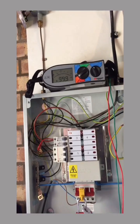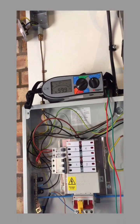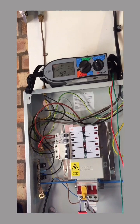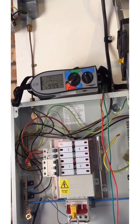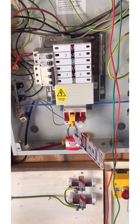At the back of our minds all the time is health and safety. Before we even get to this point, there might have been a number of procedures we've gone through, including things like risk assessment, method statements, permit to work — that sort of thing. Anyway, it's a dead test and the board has been safely isolated.